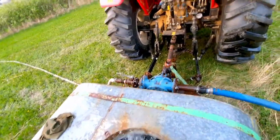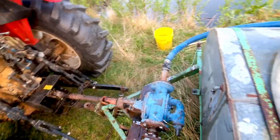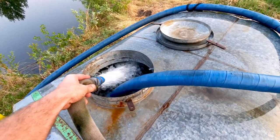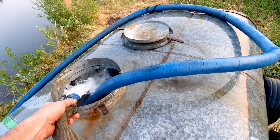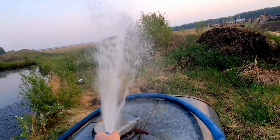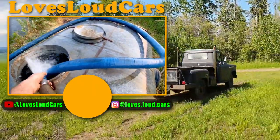She's working. I put my PTO in at an idle at a thousand RPM and it took about eight minutes to fill up. Then I threw the suction hose in to see if it would work — obviously sucking out of the tank and pumping back in. At this rate, at an idle, you should be able to spray water for 10 to 15 minutes. I just got to remember where I had my fire nozzle, but you could wet down a whole bunch of grass fire with this in just a few minutes. So I guess we're successful.